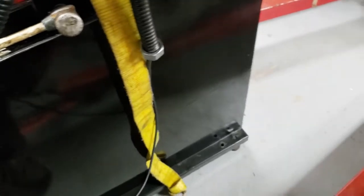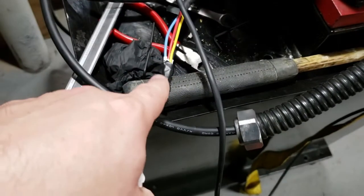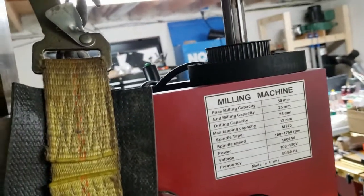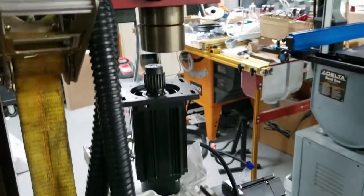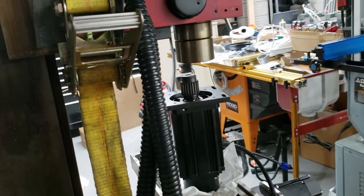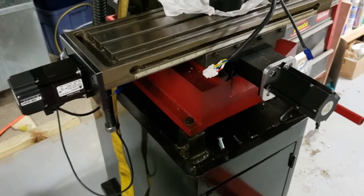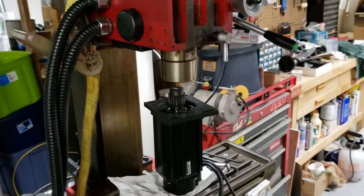The spindle cables are run through the original flex piping. For the power side, I took the connector off and wrapped the end with some electrical tape. Did the same thing on the blue connector for the encoder — a little bit of electrical tape helped everything slide through. I still have to bolt the motor onto the adapter plate, drop everything down, hook up the pulley, and bolt in the ball screws for X and Y. I need to do X before Y, so two little bolts and that'll pop out easily.